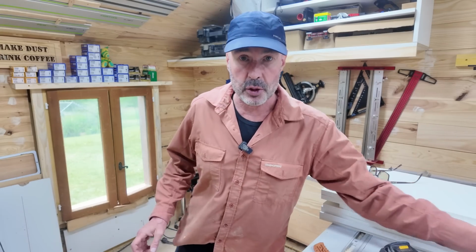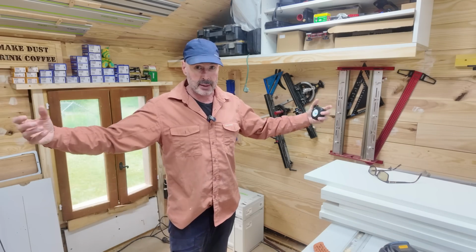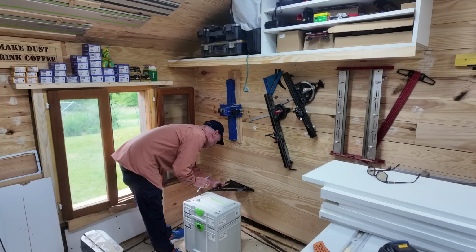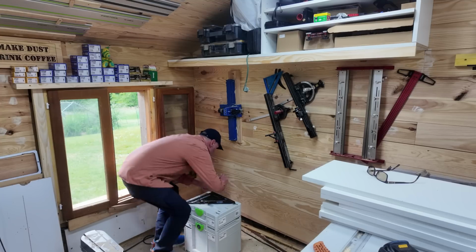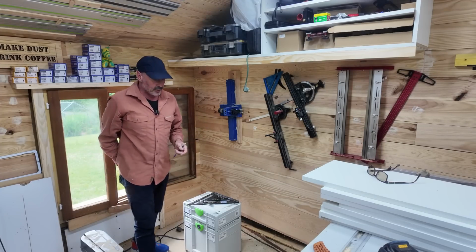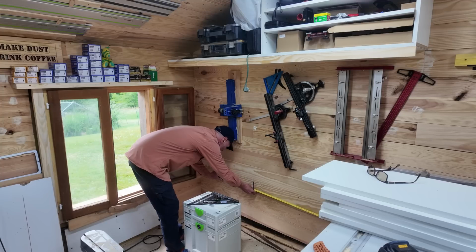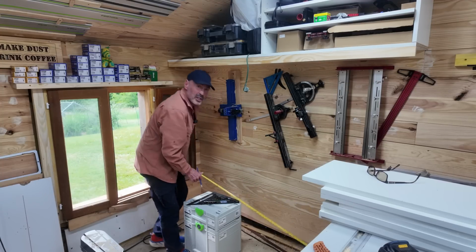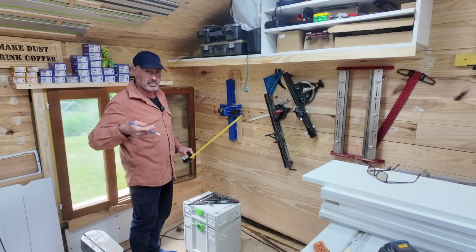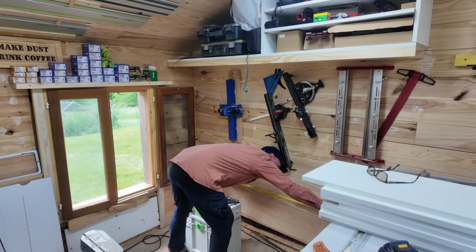So the first thing I need to do is work out how much space I've got, or indeed how big I can make this thing. So the restrictions on this side of the arc of this window, that's kind of there. That side, of course, the saw. Now I've got this upkick curb in the floor here. From there to there is about 1300. So logically is to make it on a 1200mm module, just because that's sizes of timber. We'll say 1200mm to there.